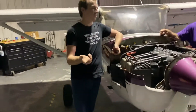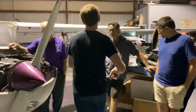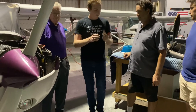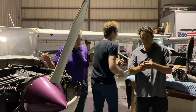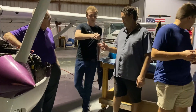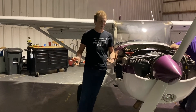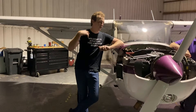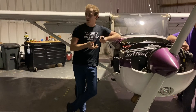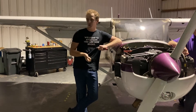If the engine starts running rough — say it was running fine 30 seconds ago, you switch to the left mag, and now it's running rough and shaking the instrument panel — most likely you've got what's called fouling. That is a bad spark plug, and this is a good spark plug. What's building up on the plugs is lead. We have lead in our fuel — it's called 100 low lead, though it's not really low in lead. Lead is used in the fuel to boost octane and also help lubricate the engine, but that octane booster builds up and crystallizes. When the fuel ignites and burns, you get crystals of lead building up on spark plugs, and when it builds up enough, that spark plug is no longer allowed to fire. Spark plugs all work off arcing.